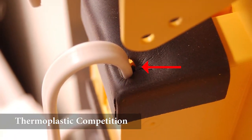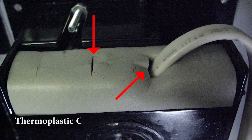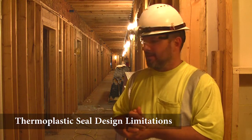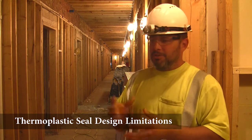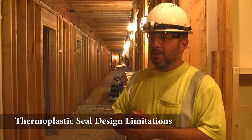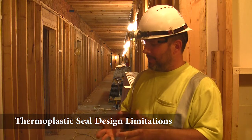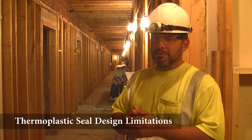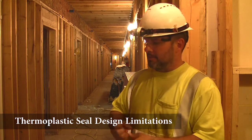Competitor boxes often claim to prevent air leakage with unreliable foam gaskets to cover cable entry points, but often require additional materials and labor just to pass inspection. I don't think any of them self-seal the way they're intended to on a job site. When they're installed in the wall and you get a couple of wires in there, there's no way they can fully seal the way that flange is meant to. In a factory it probably works great, but by the time you put it in the box, take it out, or pull the nail-on box from a container, it's stuck to something else and that flange rips off. Or you put the wire in and it pushes so hard — you've really got to wrench on it to get the wire in the box in the first place — and then it rips the seal. You have to seal it yourself.